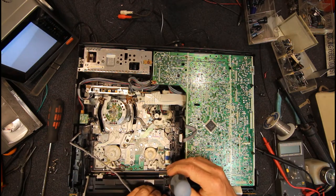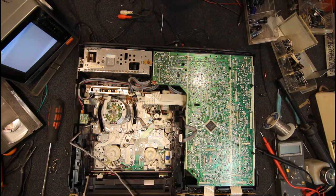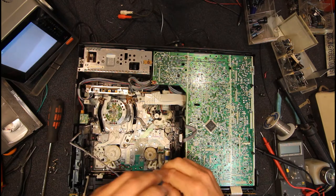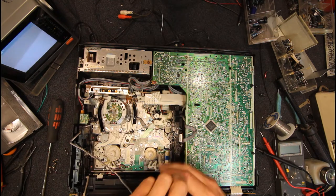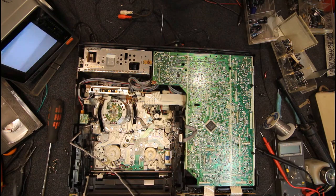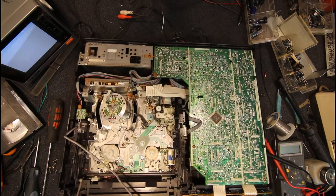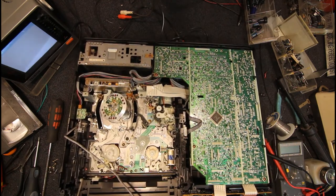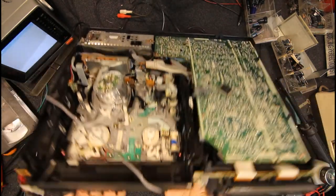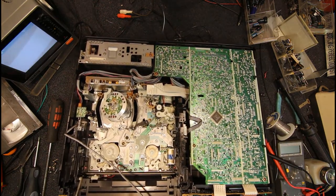And our door's just popped out a little bit, so another thing to keep an eye on. While this thing's apart, the door can easily pop out, as these bits can flex apart more and the door can pop out of its locating holes. So that's all back, so again we can use the solenoid from above, or we can flick this little lever from below. Where is it? There. So you get quite adept at it if you do enough of these.